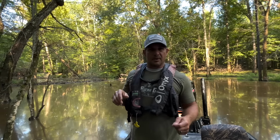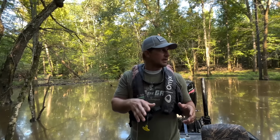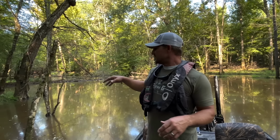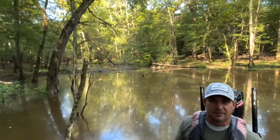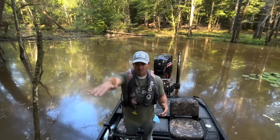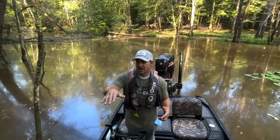I mean, if it's shallow, I try to hit the jack plate up a little bit, but if you can get up with the jack plate up, that's ideal. Get the jack plate as high as you can to get up on pad, I should say. But you want to have a clear shot. See, I hit a couple other limbs. I figured I could still just plow through them, but I hit a couple of limbs, which slowed my momentum and didn't really propel me all the way. I got past more than halfway, but that's the deal.